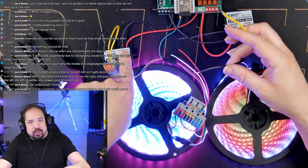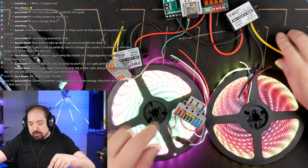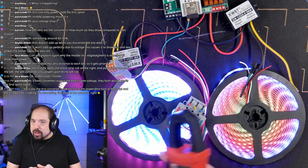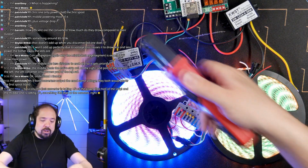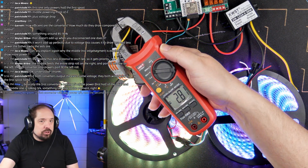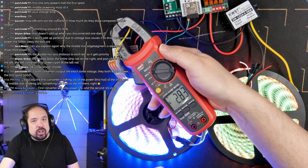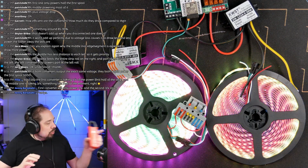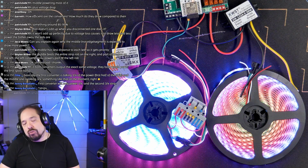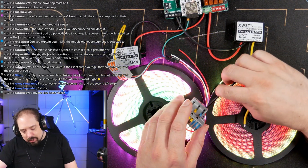That means that now everything is being supplied by this DC-DC converter. And that is in part the reason why you don't want a setup like this. Because if this DC-DC converter wouldn't have a limit, it could potentially be being overdrawn, basically. Because now it's delivering almost 3 amps instead of the 1 point something that it did before. Now, it's a 5 amp converter, so that's no problem. So maybe you can connect everything together as long as you make sure that each individual converter can survive if one of the others fails. We can think about that. Is that a decent conclusion?